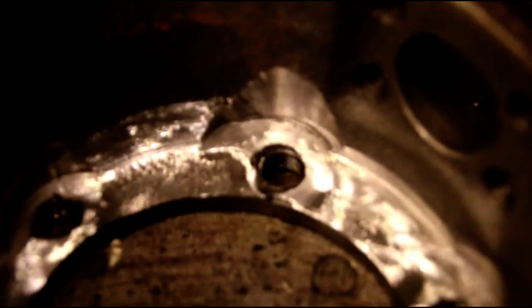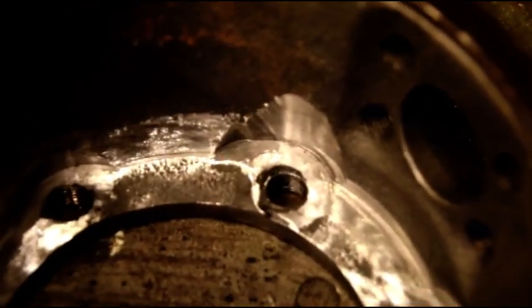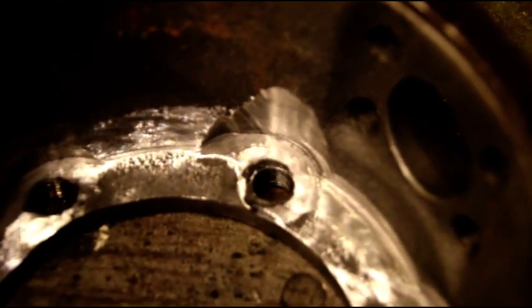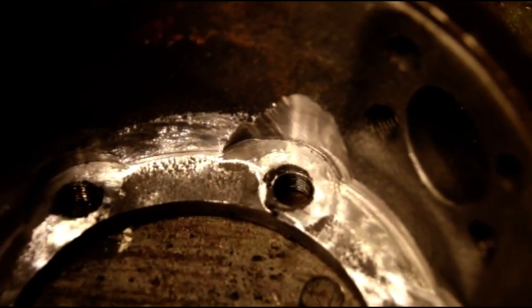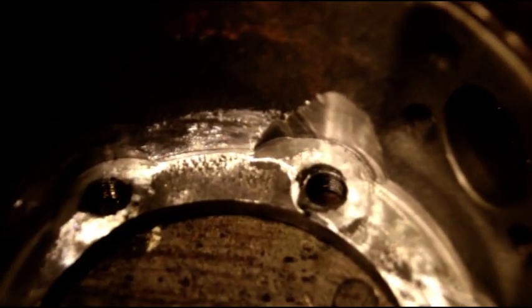Okay guys, here's a knuckle that you can see. I set it up on the rotary table. I ran and flattened all these guys out in a circular pattern, and then I cut enough of a recess in there to fit our bolt. So on the mill with a rotary table is a good way to go — it works fine. And if you've got a bunch to do, it's easy to do. The third way is all by hand, and I'm going to show you that now on Chuck's knuckle. It's something you can easily do at home.